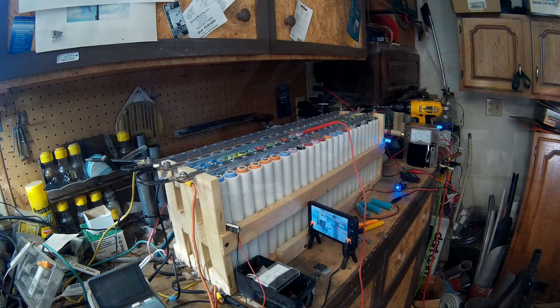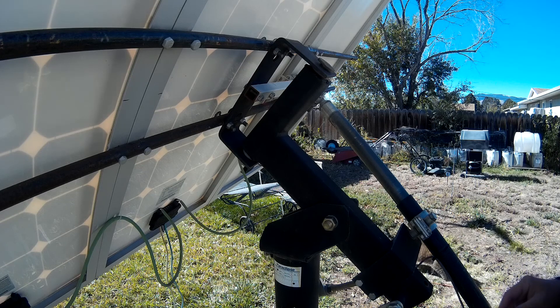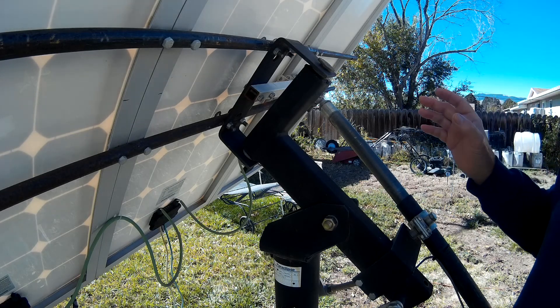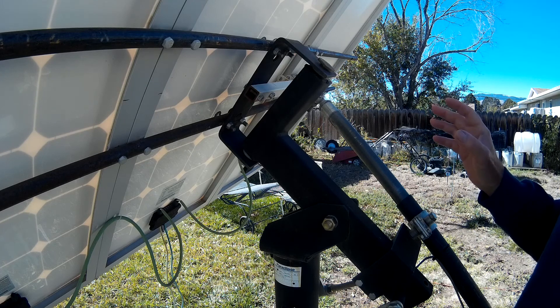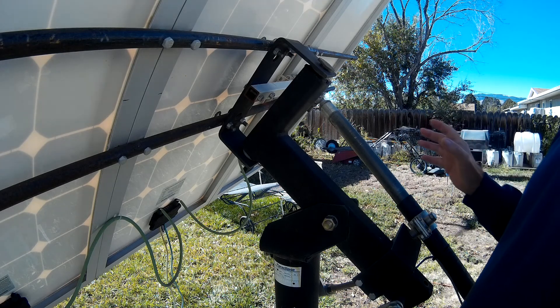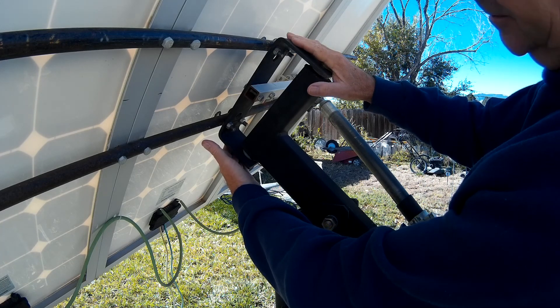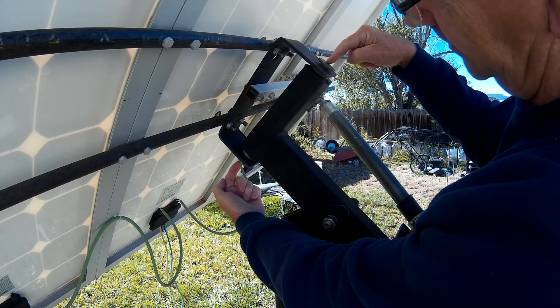Let's go outside and I'll show you what we're going to do. Here's the back side of my old satellite dish mount — one of those old C-band satellite dish mounts — and I have three solar panels on here. For good sun tracking, instead of using a compass or any fancy equipment, when you're setting up your solar tracking, before you mount this, wait till the stars are shining at night, set all this on your post, and then just eyeball through this hole here to the North Star.